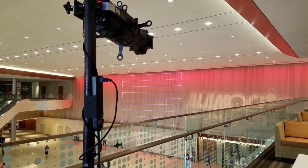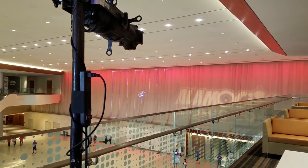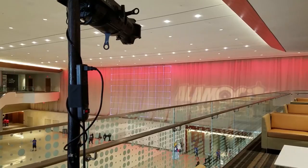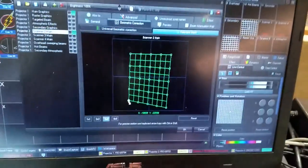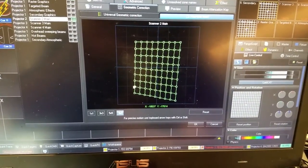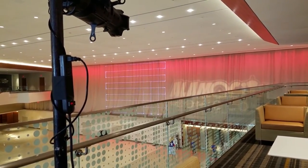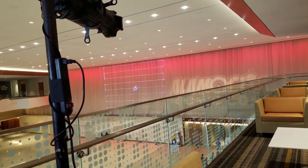Now you see we've gotten all the new areas with the 5x5 alignment. I had to go back again because every little adjustment you make is going to affect the overall image. As I was making those adjustments, I did have to go back and readjust my corners and readjust my top left, right, and bottom centers. But now we've got a pretty good image. It's still worthwhile to fine-tune with the 9x9 pattern — now I've got geometric correction capabilities all over my entire grid. I'm going to start with the top left and go over all the intermediate areas that have now been reintroduced and fine-tune those.